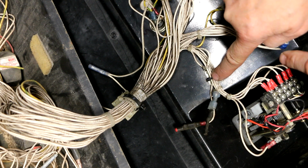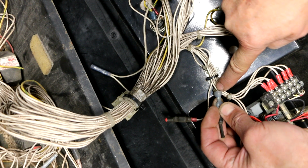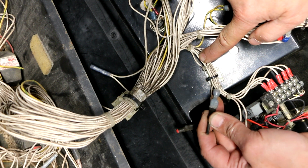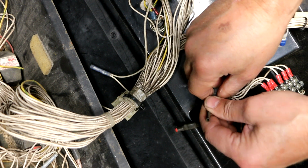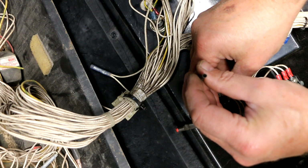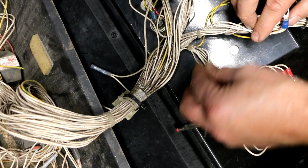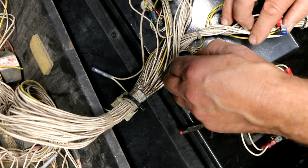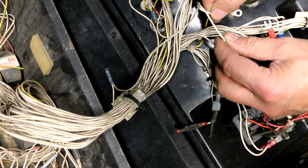And it only comes over to here, goes right to this termination, and then has another 32 wire come right out of it. So this would probably be option number 1 connection, which right now it has just this stuck in it, which does not appear to have ever had a wire attached. So I think this is option 1 that I don't have. So then 32 is right here, and it ends up being one of the 3 wires tied together here.